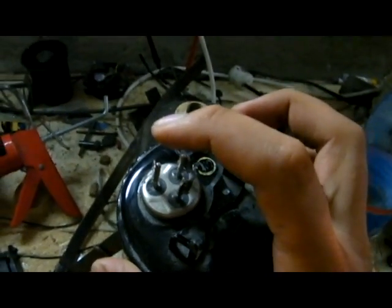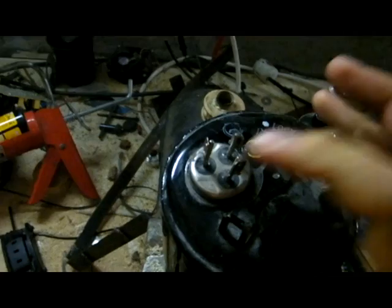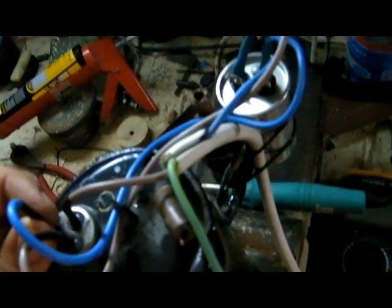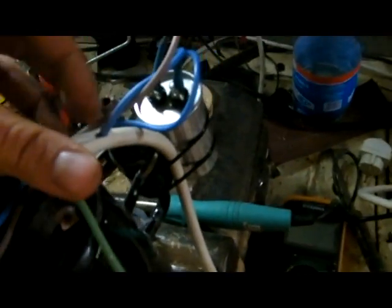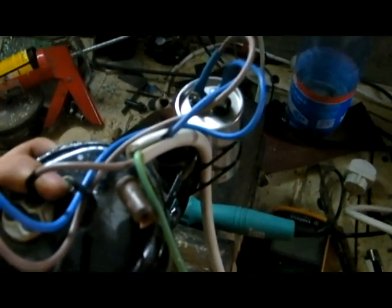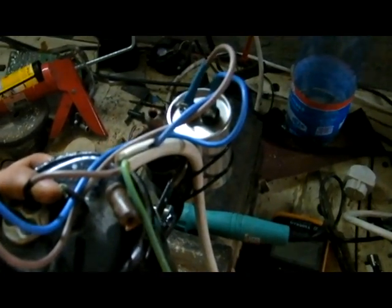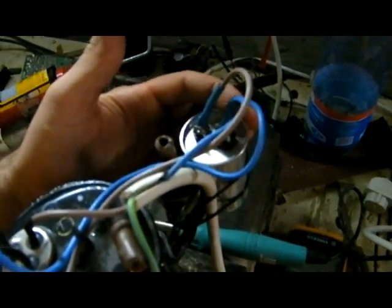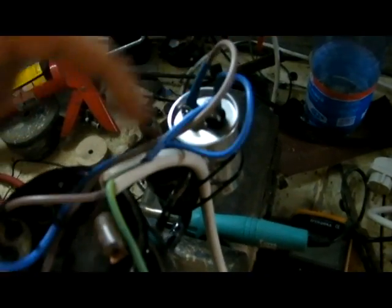Let me wire this up. I'll put a link in the description so you can see where I learned it from. As promised, I've wired it — it looks like a lot but it isn't. It's pretty simple if you've done electronics. The common goes to mains, the run winding connects to the other wire of mains, and the start winding connects through the capacitor to mains, which gives it a little bit of juice to start.